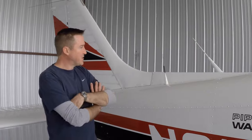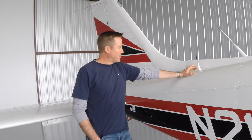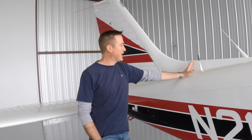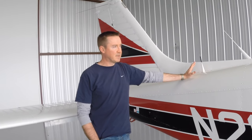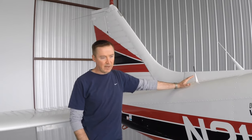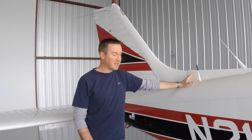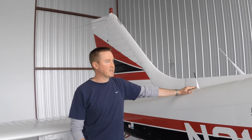And what that means is, in addition to the 121.5 distress frequency transmission, once every 50 seconds for 24 hours, it'll send out a packet of data on 406 megahertz that is going up to some satellites that are monitored by NOAA. And NOAA has this information from us. We've registered this unit with NOAA. And if that satellite system starts to receive a signal from this unit, it knows it belongs to this airplane. It knows it belongs to us. There's emergency telephone numbers connected to it. And if there's an emergency like that, they can come get us and find us.